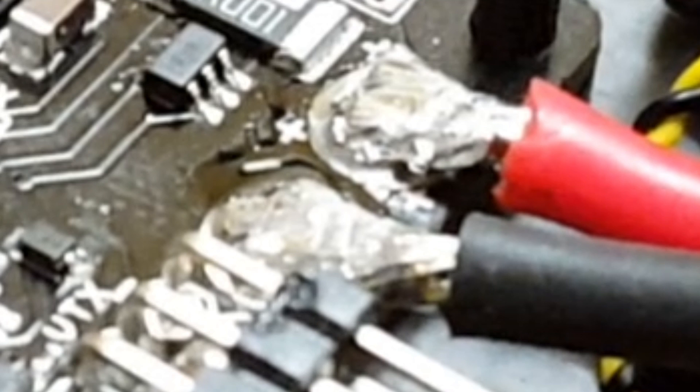Then while holding it with the tool, I'm going to hit the joint with a good amount of heat and really make sure I completely flow the whole thing, making contact with both the pad and the wire. Watch how it flows — you can really see the whole thing turning to liquid and flowing down, making a good complete fillet up against the pad. I give it just enough heat to get it stuck, and then you could call it a reflow: I hold it in place with a tool and reflow it with full heat to make it really flow.